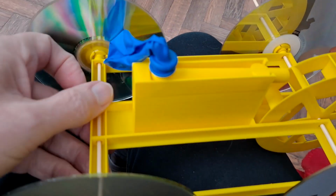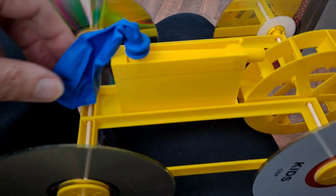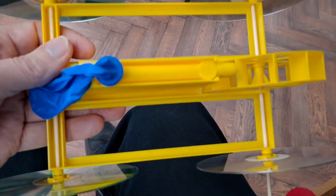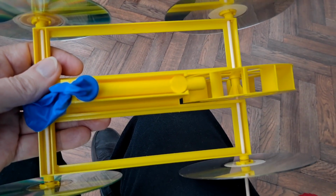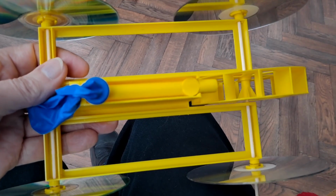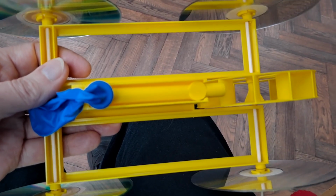That's another reason we got these ridges up the side, so it doesn't fall directly in and wrap up the axle. Just little design features that I haven't really gone through why it's this shape. One of the other reasons it's this general size and shape is that's the limit of the printer bed. If I want to go any longer, then I have to print it in sections and join them together. So that's just about as wide as you can go, or as long as you can go, to be more exact, on the existing printer bed.